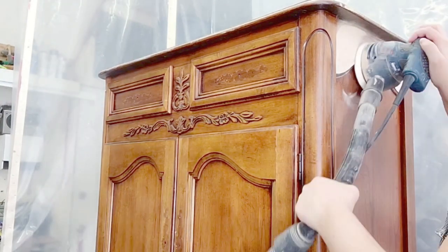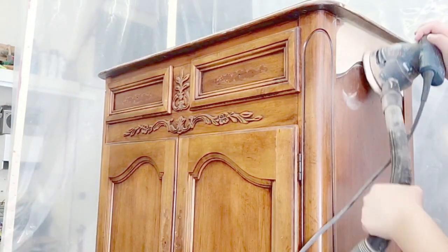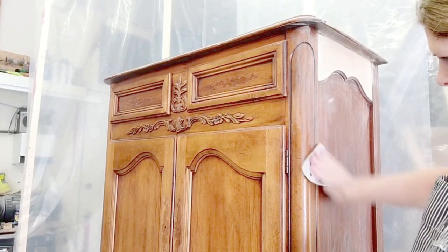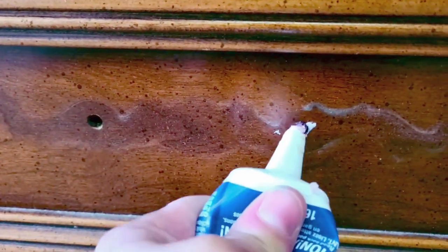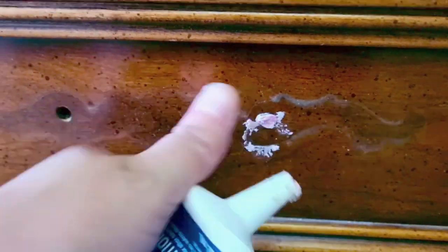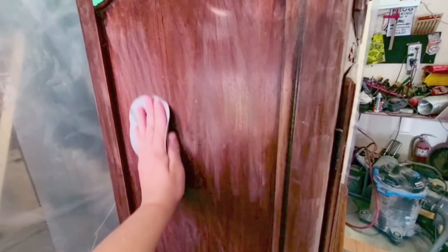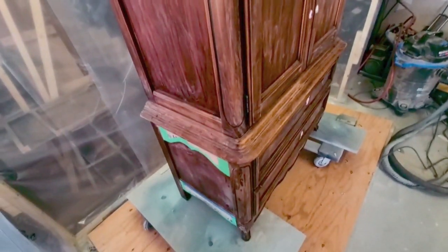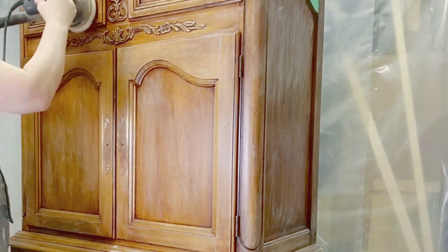You don't have to do this on your dresser, but I got a little bit creative and sanded off the panels on the sides to raw wood, and then I'm going to stain them with glaze — I will show you how to do that. Then I scuff sanded the entire piece and filled in one of the holes where the handles were, because I was changing the handles on the bottom drawers. I used spackling wood filler — it's really good for little holes and it dries. It goes on pink but dries white. Then I covered up the wood panels that I sanded with painters plastic tape.